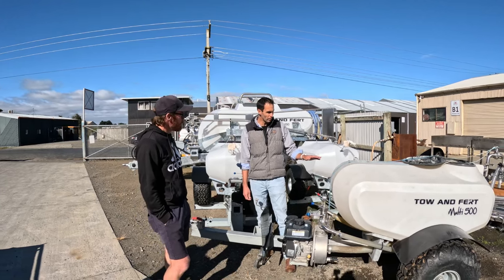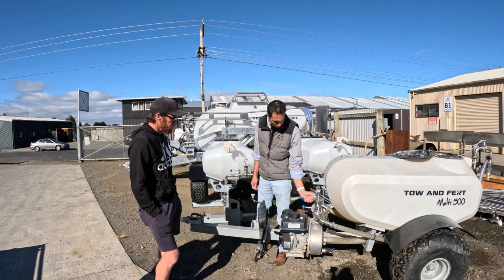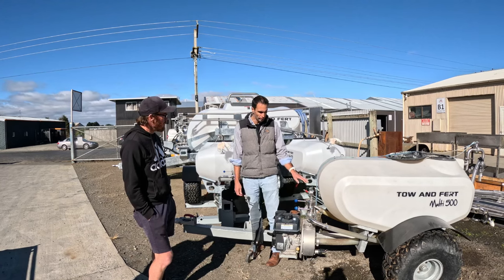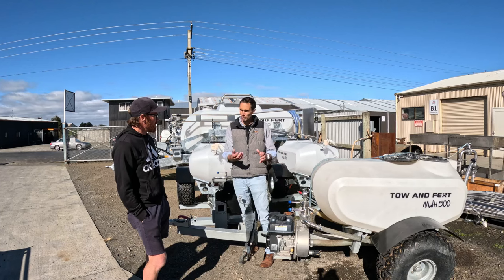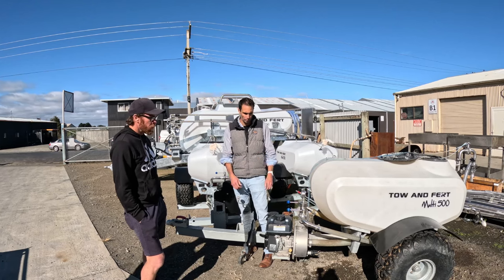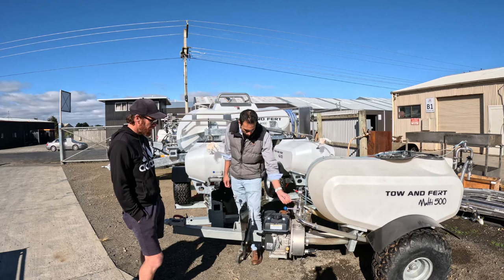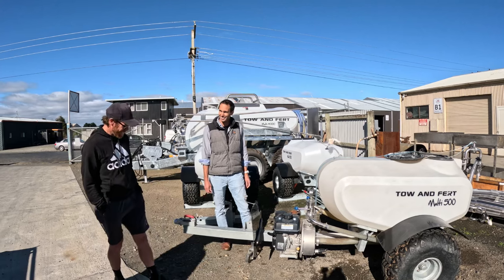When you want to empty the tank completely, it's often better to have that agitator completely off, if you don't need mixing. When you get near the end, turn that completely off so it's not pushing all the product away from the suction port. That makes sense. We shouldn't be able to mess that up too much. Hopefully not. Famous last words.